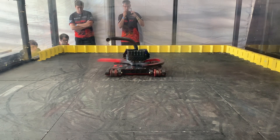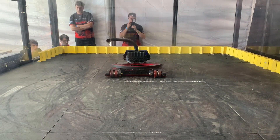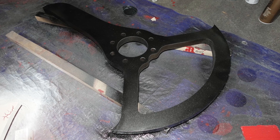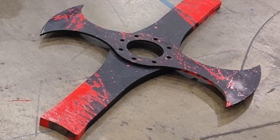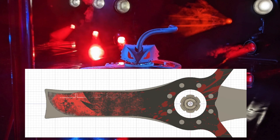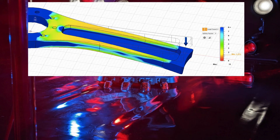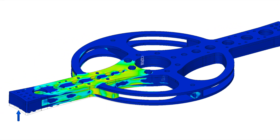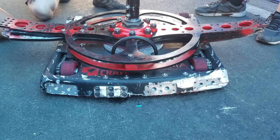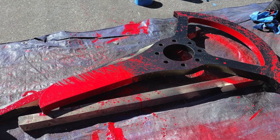At an inch and a quarter thick, this bar matches the thickness of our Season 5 thick bar that took down Endgame, but without any of the pocketing underneath. This is made possible by the wide counterweight, which serves the same purpose as the stabilizer wings on the old bar without adding nearly as much weight. Comparing the cross-sections and FEA for the two blades, the Chonk Key is beefier and stronger than the old thick bar, despite the lower yield strength of AR500. It does not match the theoretical strength of the club sandwich, but then neither did the club sandwich, so we're confident that this is closer to an ideal solution than anything we've run before.